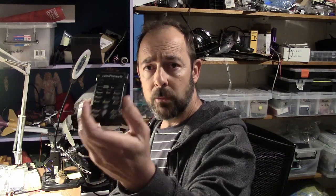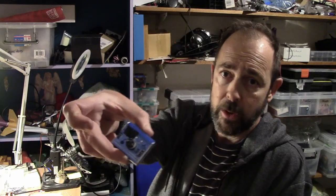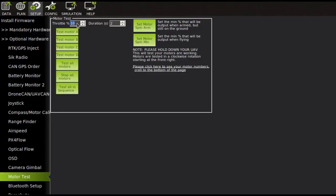In order to make this happen, I've got a set of kitchen scales, an ESC, and an old Pixhawk flight controller. The reason I want to use this rather than just using radio control or a servo tester is because it will actually let me specify different PWM or percentage of thrust demands — so I can output 5%, 10%, 15% demanded motor speed and measure the thrust at each of those percentages.